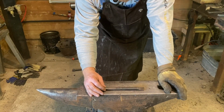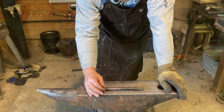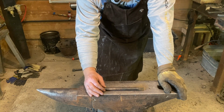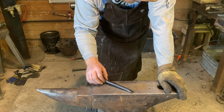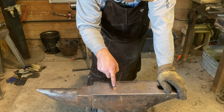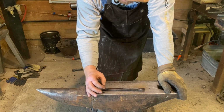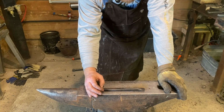We've completed the heat treating process through the hardening and the tempering. We did 3 normalization cycles prior to hardening, and then we did a cycle of, actually 2, of tempering. You can see we have colors that are run down in here. We got into that little bit darker yellow, not quite into the purple.